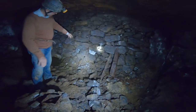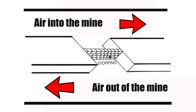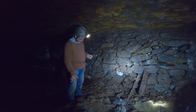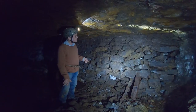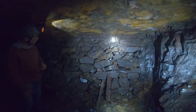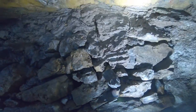This structure here is a stone wall — it's a stopping. You've got to guide the air current around the mine to make sure it ventilates as much of the mine workings as possible, so some of these passageways are blocked off with these stoppings. This was built by the miners well over a century ago, and at some point to make it even more airtight somebody's attempted to smear mud on it. As you can see, there are all the hand marks of whoever smeared the mud on this wall, possibly a hundred and twenty odd years ago.